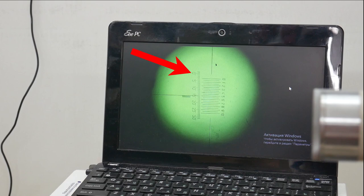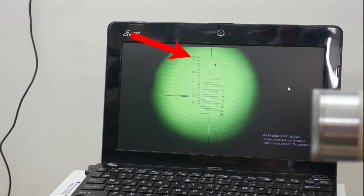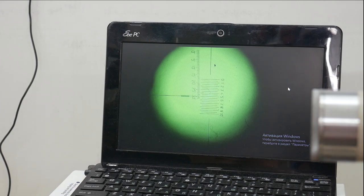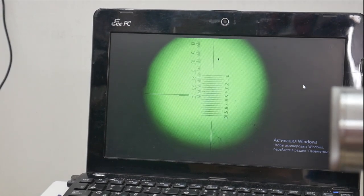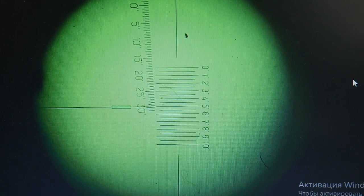We rotate the knob of the device, moving the mark to the zero line. The arc second scale moves with factor much faster than mark. The mark has become on the line zero, and the scale shows the angle of the inclination of the mirror that has arisen. The result is a tilt of the mirror 30 arc seconds.